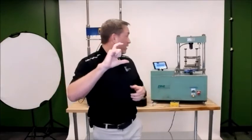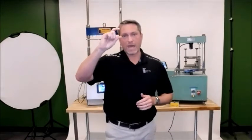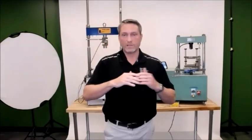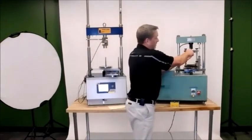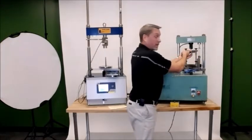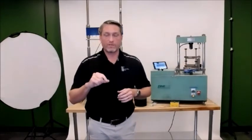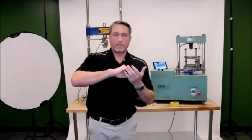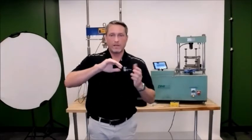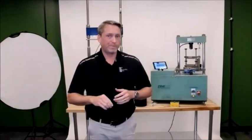So for this one, we have that long 2-inch LVDT, which has plenty of stroke length. So you just want to make sure that it makes contact with the magnet before the load is engaged, basically once the machine starts moving up, before this cross beam hits the load cell. So you always want to make sure that the displacement starts reading first. And then on the finalized graph, you'll see the LVDT won't actually put out data until the load cell is engaged. So everything starts at the same time, which gives you your proper ideal CT number.